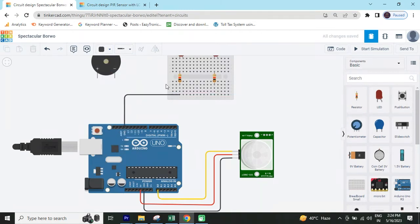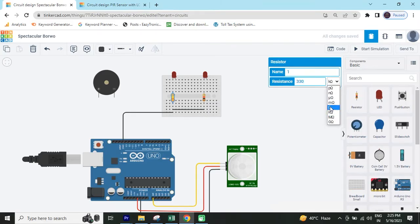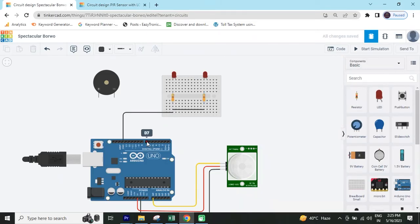Make the color black. We have also connected this resistor to the ground pin. Now change the value of the resistor from one kilo-ohm to 330 ohm — here and also here, change to 330 ohm, not kilo-ohm. You can connect any digital pin to the LED. First we connect the LED to digital pin 7.